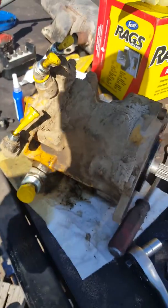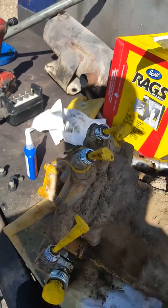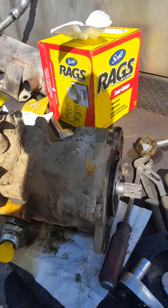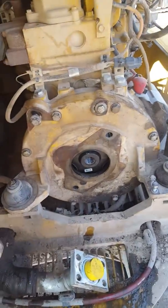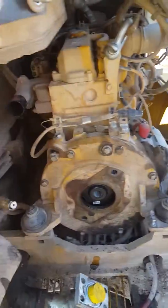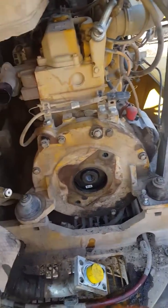You're going to want to bleed it. Make sure that this pump has hydraulic fluid in it before you keep going, then cycle it through, watching your sight glass on your hydraulic tank — making sure that the air bubbles get worked out and that it has a sufficient amount of hydraulic fluid to keep the machine running. That's how it is. This is step two of the procedure of changing a coupler on your mini excavator 305.5B Cat.